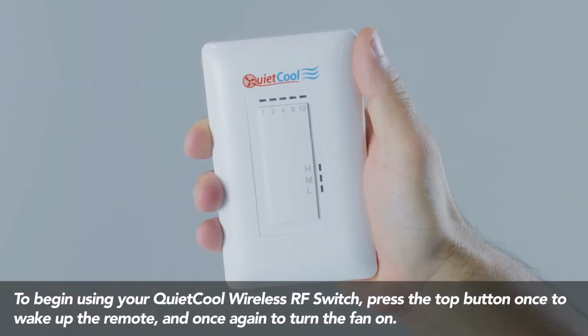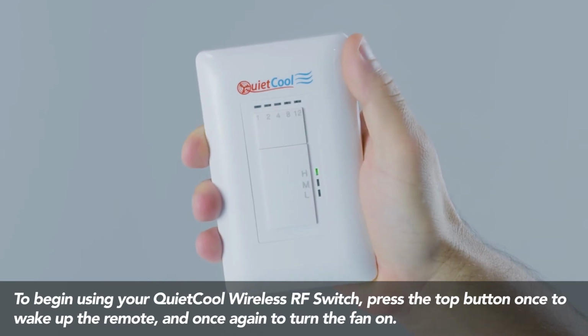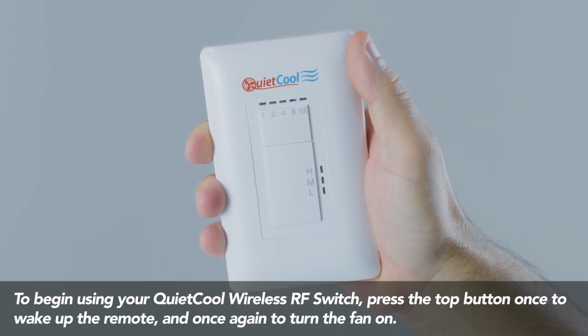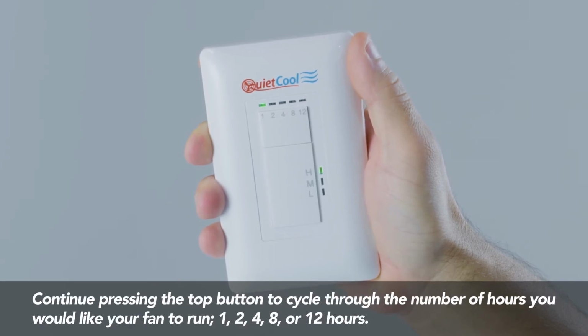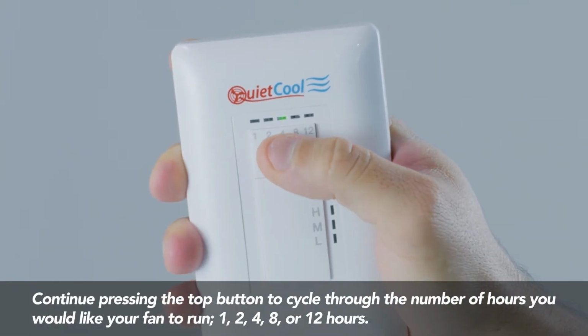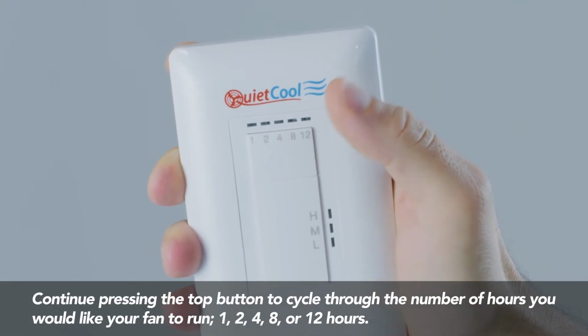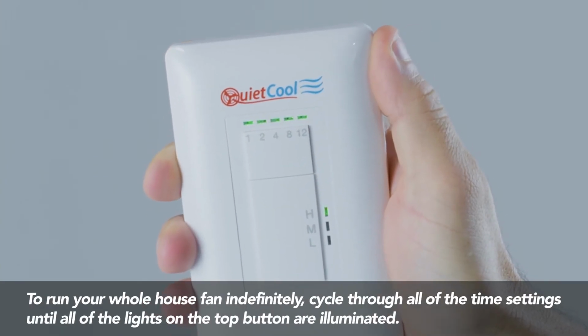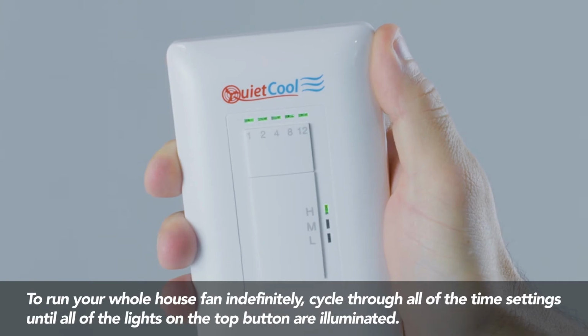To begin using your QuietCool Wireless RF switch, press the top button once to wake up the remote and once again to turn the fan on. Continue pressing the top button to cycle through the number of hours you would like your fan to run: 1, 2, 4, 8, or 12 hours. To run your whole house fan indefinitely, cycle through all of the time settings until all of the lights on the top button are illuminated.